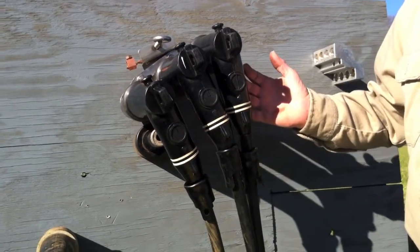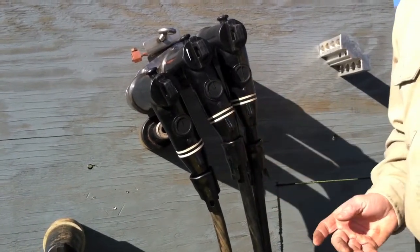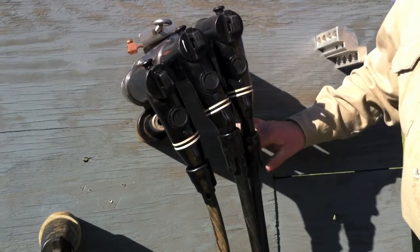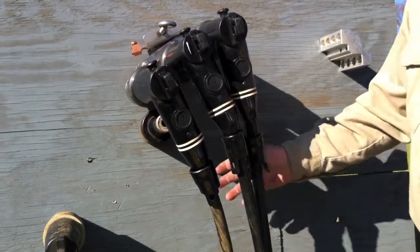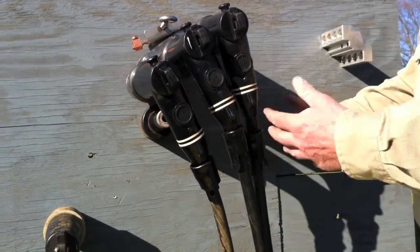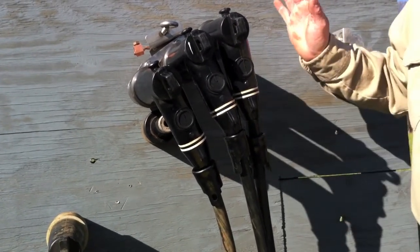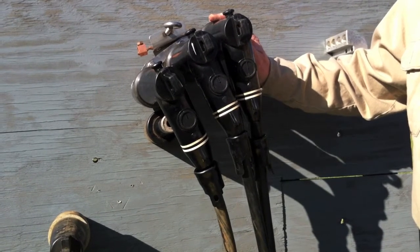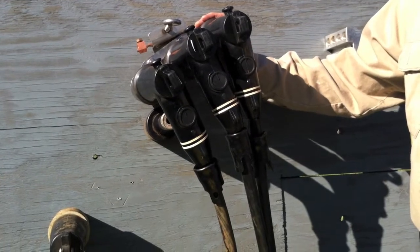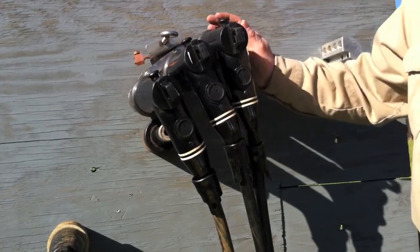Here you would just pull off a cable and de-energize your pot and be able to work and still leave your loop intact. If this transformer goes bad and you need to change it out, all you've got to do is pull your pigtail bushing off, and then you can isolate everything, have your crew set up, ready to go. I propose dropping the switches and then changing the transformer out, getting the transformer put back in place, putting this junction back on, covering it up with a blanket, and then energizing it back, and then you can finish up your transformer.